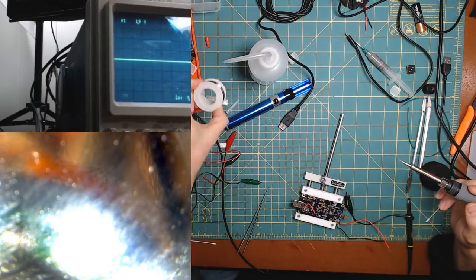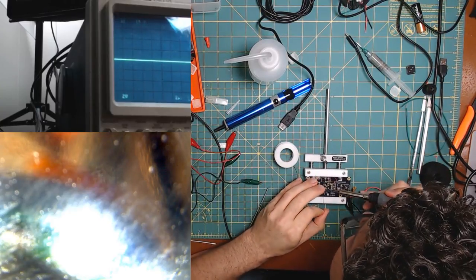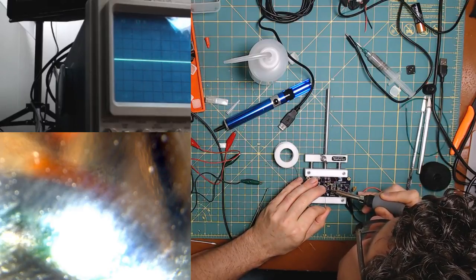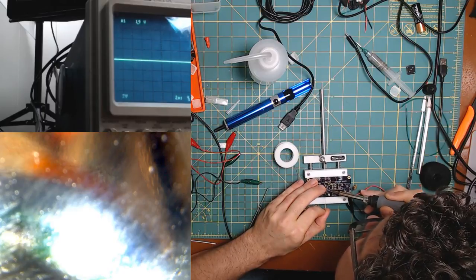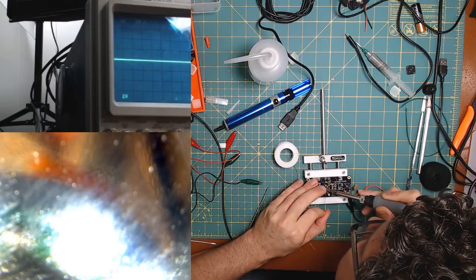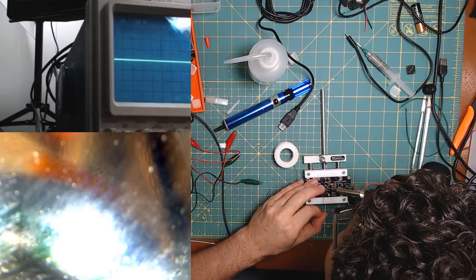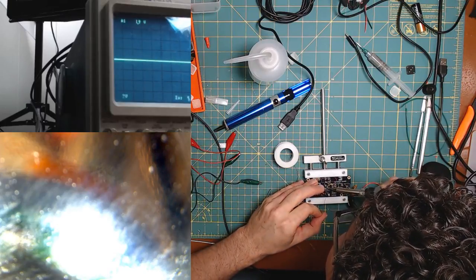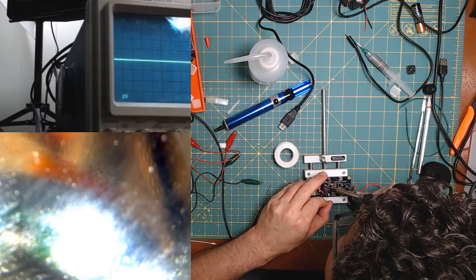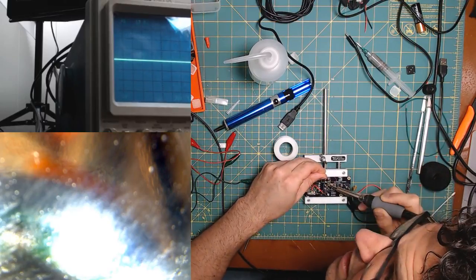You know what? Let's try with solder instead of flux for the rest of them. Usually when the pads are this tiny, I can't use solder, because it just ends up balling up on the tip. But here I'm actually using the tip to deposit some of the solder on the pad. So it takes so little. Maybe this will work. See, you can still see.